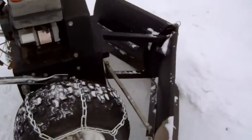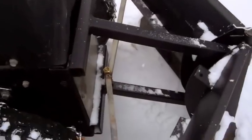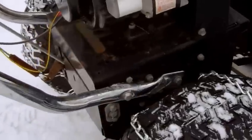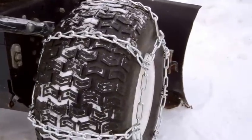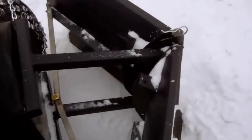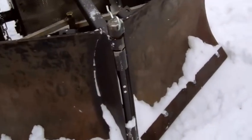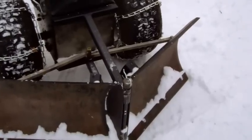Thought it'd be a little better for plowing paths and stuff. Just take an old snow blower, take the whole front — the cowl kind of thing — off of it, so you still have the drive. I had to change the axle on it to accept these big garden tractor tires, and put some chains on there, and just a simple plow mount. I just took an old garden tractor plow that I had around, cut it in half, put a hinge in the middle, so you get the v-plow kind of thing.